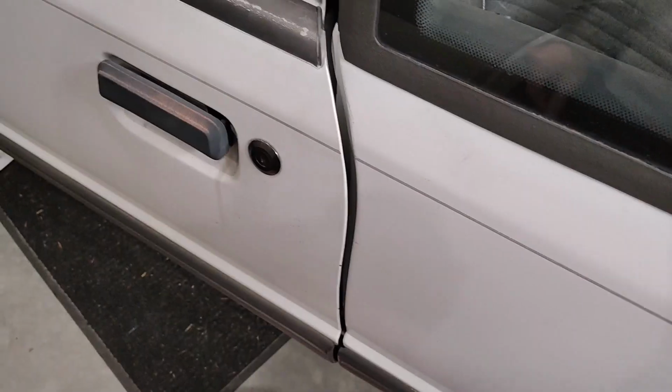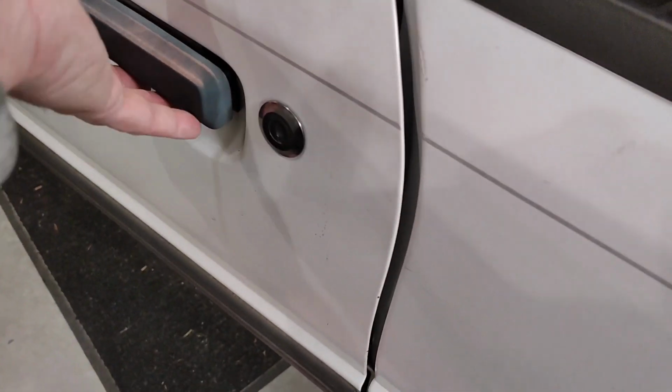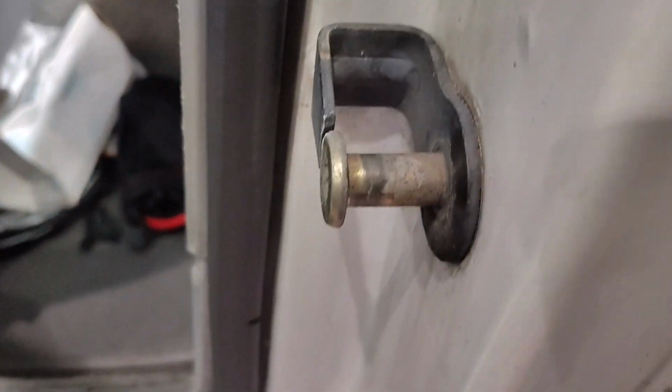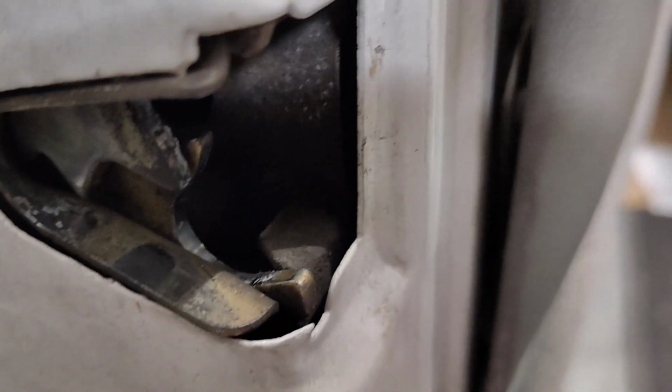Stand by. What clued me in on the other side was that something was odd. So listen to how it opens. Real high pitched. There's the strike without its bushing, so it's a lot smaller, so I thought maybe this needed to be greased. Threw a little garage door grease in there, probably not the right thing, but what are you going to do? And at this age, I need a little grease, so to speak. So listen to this. And it didn't shut very well. See how it just sounded weird when it popped open.